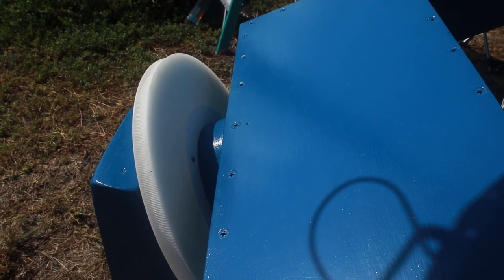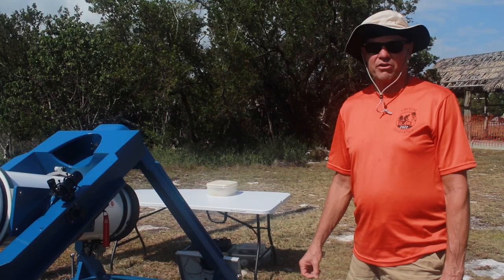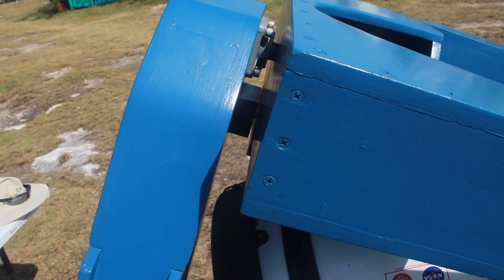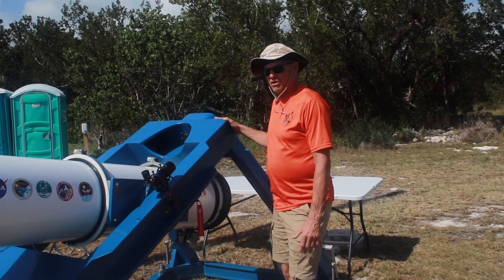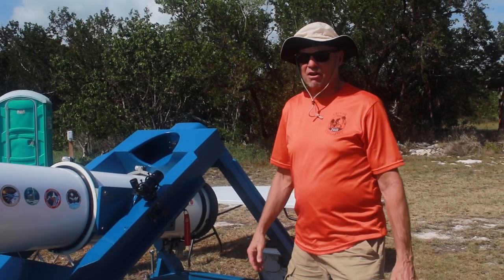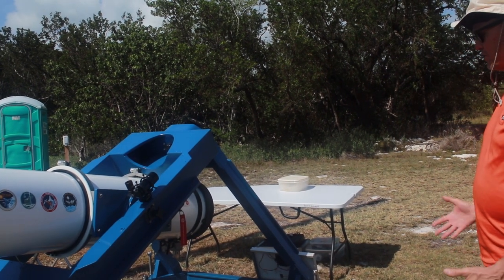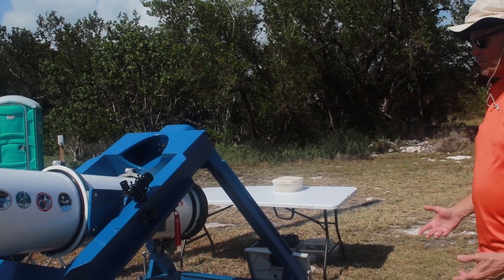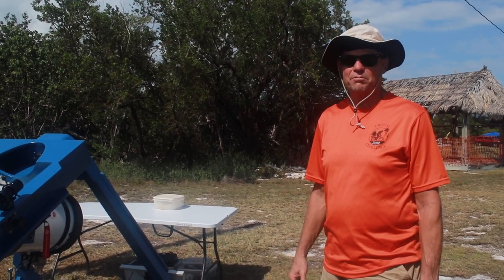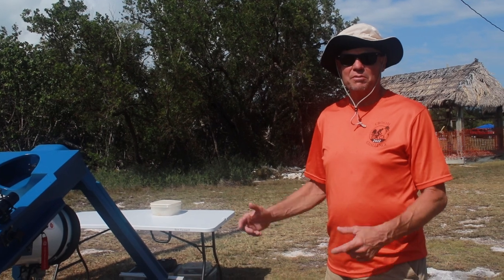I made it myself, but I had a friend who owned a machine shop that helped machine all the parts, and another friend with a woodworking shop with fairly large machines, because the yoke had to be fairly precise and square. It's also a box section, so I have minimal orthogonal error — that worked out well.